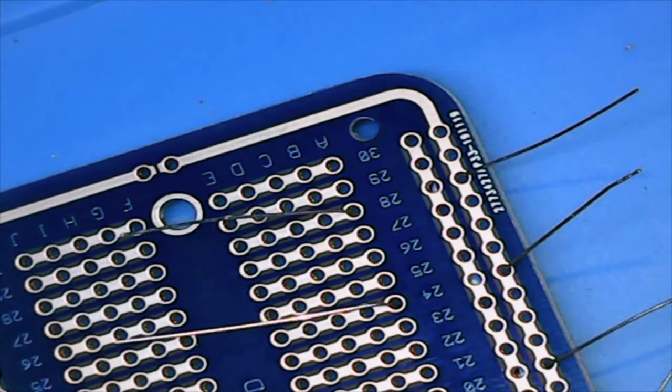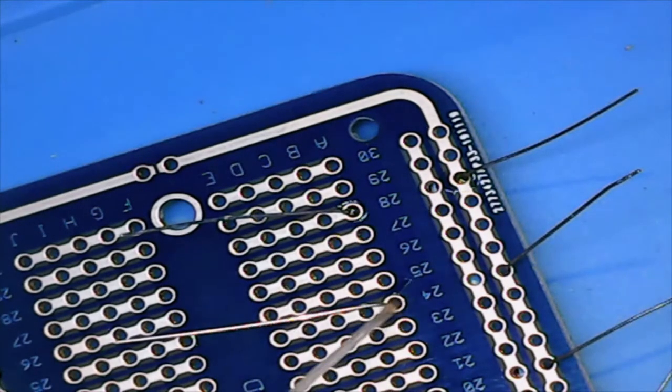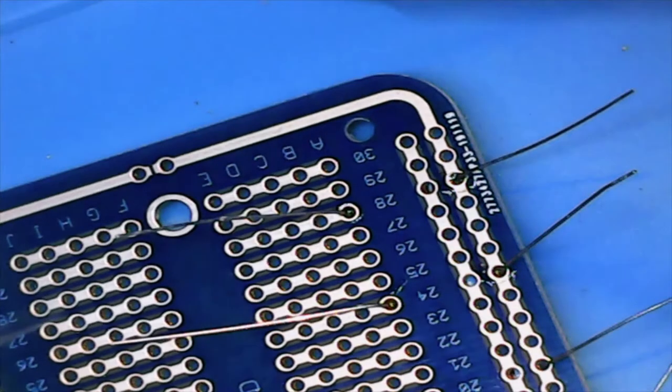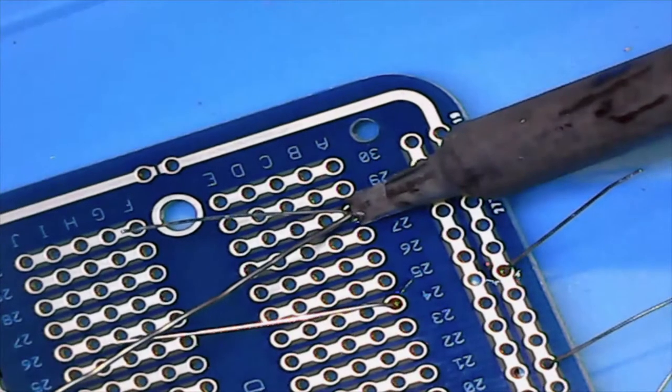And as we've talked about, handy flux. I like a liquid for through-hole projects. I'll put it on camera when I have the other camera back up. You can actually get one that looks almost like a magic marker, and that's better for surface mount. And then sometimes you'll see a paste, and that's best for wires. I do have all three laying around my workshop, of course.